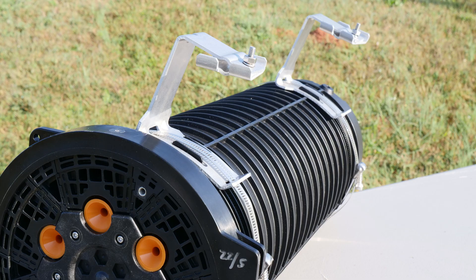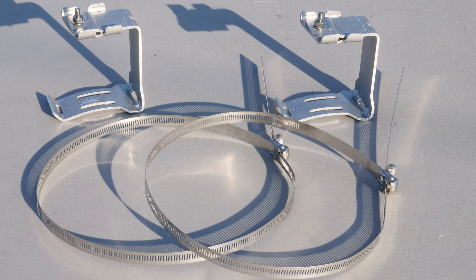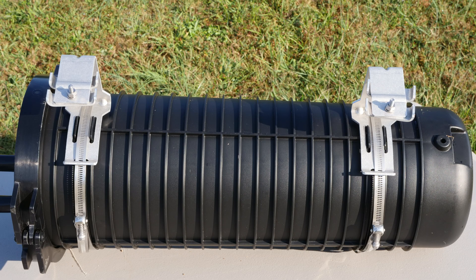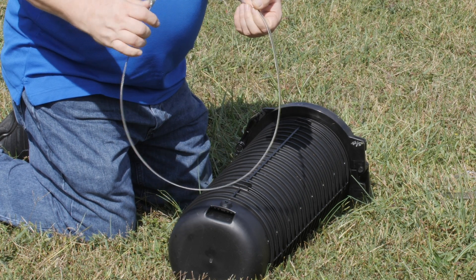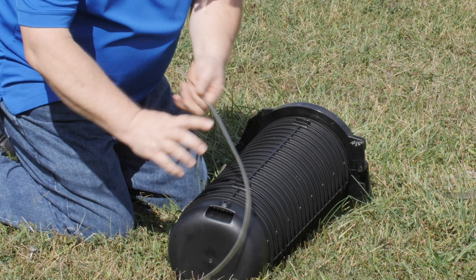Using the same method for orientation with the mount insert on top, attach strand mount brackets, which puts the basket at the bottom of the APEX closure. Each kit comes with two strand brackets and two retention straps. Set strand brackets in the same orientation on the closure dome and ensure the mount insert is installed in the mounting tabs. Open the retention strap and wrap it around the closure and feed it through the opening in the strand bracket.